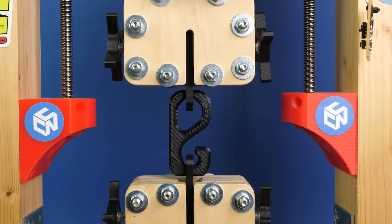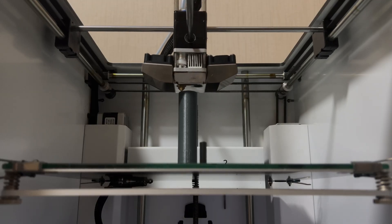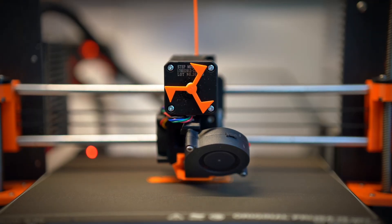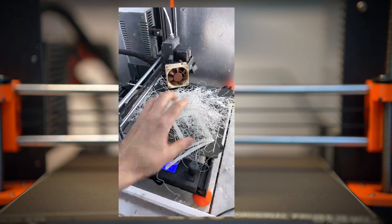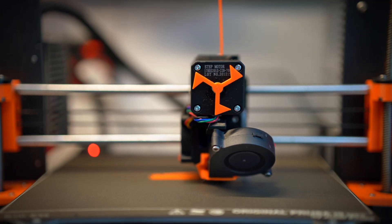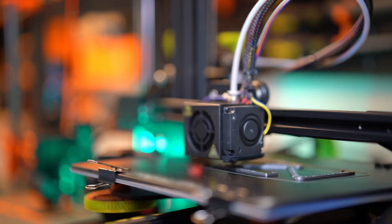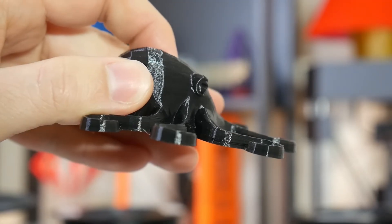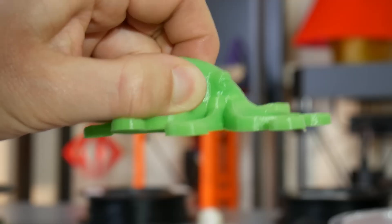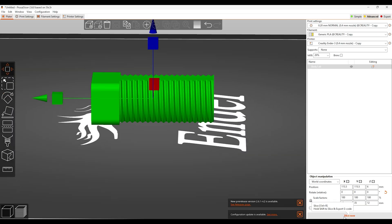If you want to print something strong and more practical, I highly recommend PETG instead of ABS. Printing with ABS is really hard, especially on Cartesian-style printers, as you need a closed enclosure with maintained temperature. One of my clients started printing with ABS and 6 out of 10 prints failed due to warping or layer breakage. So go with PETG for stronger prints, or stick with PLA for most cases — even today, 80% of my prints are PLA. For flexible items, go with TPU, which is a rubber-like filament, and it's easier to print with direct drive extruders.